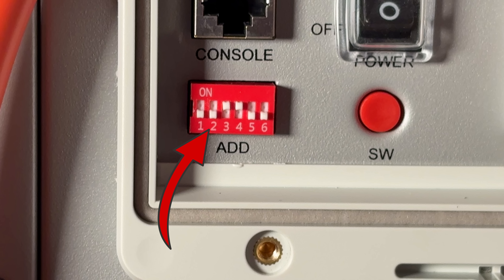Key takeaways: dip switches — 1 and 2 down, 3 and 4 up, and 5 and 6 down on your V10A. Use the COM port for communication with a standard Cat5 or Cat6 cable to the inverter battery port. Set your protocol to lithium and EG4 — that's the LuxPower protocol. The result is automatic SOC and full closed-loop control. In our test, the system delivered steady power and fast response without a single glitch. The V10A and the EG4 6000 XP are a perfect match for DIY off-grid builders.